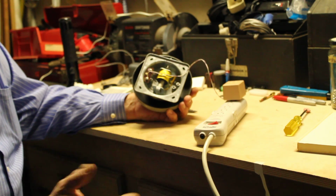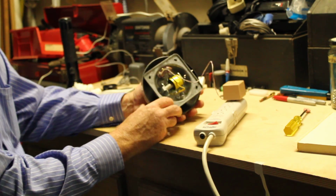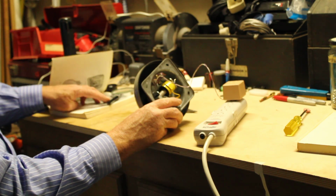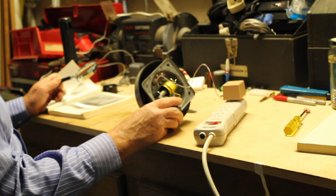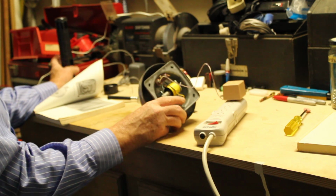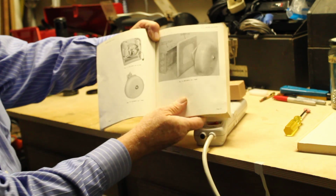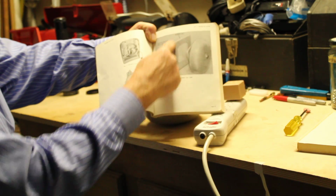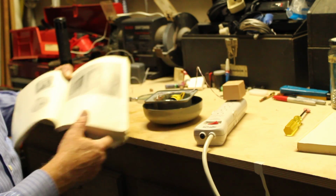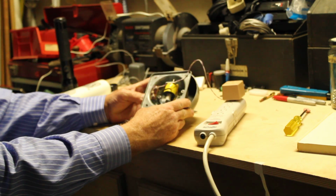This bell has an adapter on it. You take this screw off. This unit here was typically supposed to be mounted to an adapter. The adapter, which was a KS-20375 List 2 adapter plate, would then mount on an electrical outlet box, a quad, or however you want to say it, a square outlet box. I don't know if you can see the picture or not, but that's what the picture is. Here's the bell, here's the adapter, here's the box. Now, this might fit directly onto the conduit box. So once again, you see what it is, you see how it is.